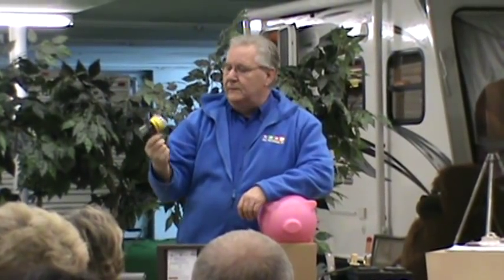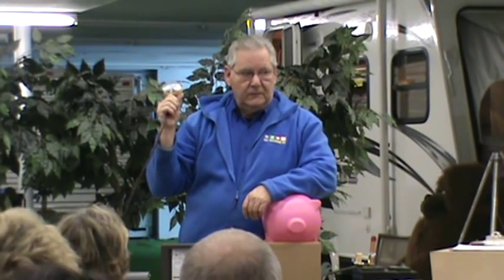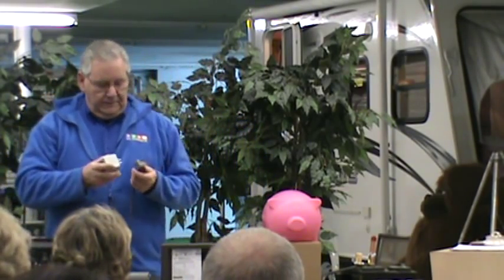You always want to be at 120. Maybe 115, that's fine. One thing you have to be aware of is when it drops lower. If it drops lower, things aren't going to run, like your air conditioner. At 109 volts, your air conditioner will not run. Your fan will run, but the compressor won't run.